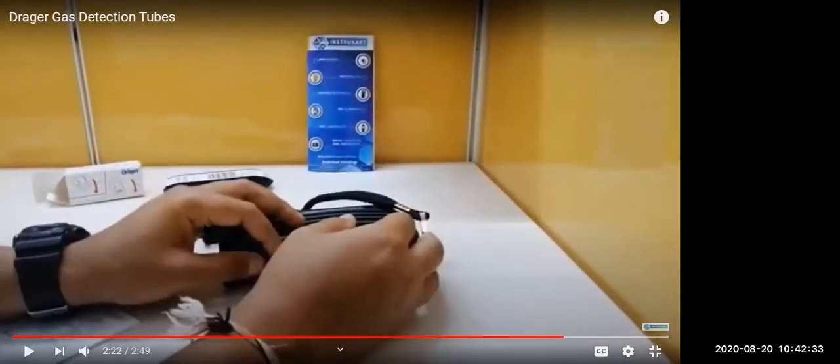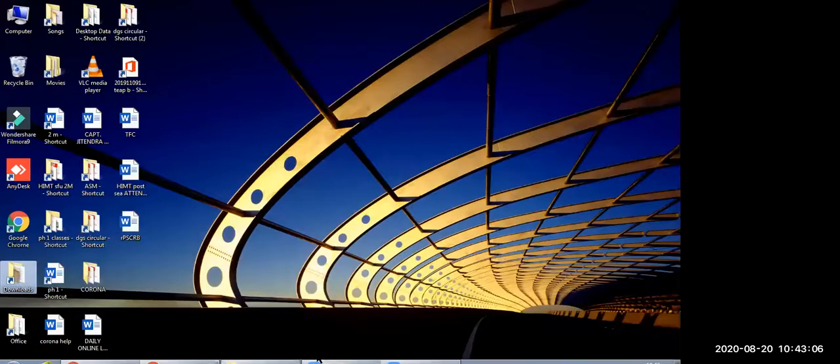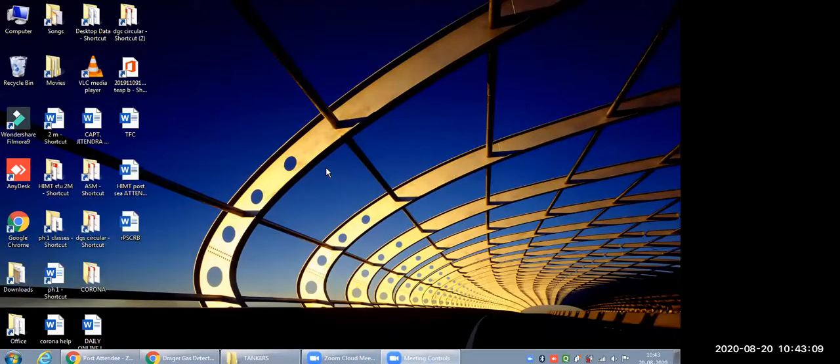The gas from the tank will come into this tube and it will change the color. Inside the tube you will have the manufacturer instruction showing how much color or what color is changing up to what scale, 1 to 10, and as per that you can count the ppm of that gas, how much gas is present. Also the expiry and the carriage temperature of this tube is mentioned in the tube box. So that's it about the gas meters.